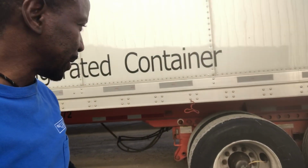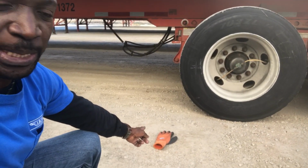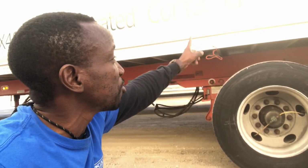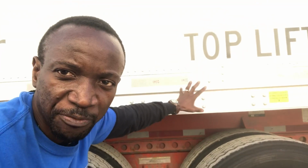So again, as you can see, my moving reference point is in line with my stationary reference point. So the idea that you have to remember is, you have 2 reference points that you need, the one that is moving and the one that is stationary. Always you put the moving one the hole where you want to be. So I would advise you get like a sticky note and put it where the hole where you want it to be at. This is going to be the moving reference point.